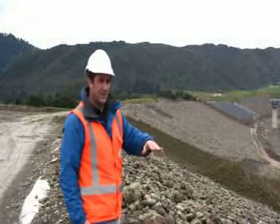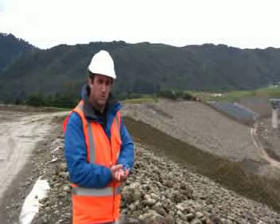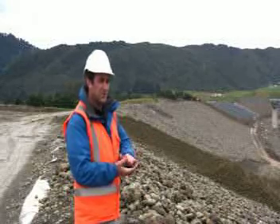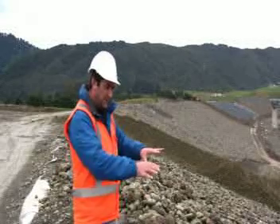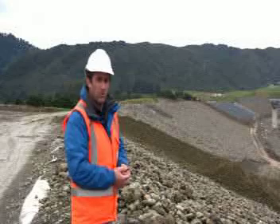Originally this lake just had an impermeable layer which holds the water in, with the topsoil on top as a filter layer, and then this rock sits on top just to stop it washing away and being eroded — like wave protection.